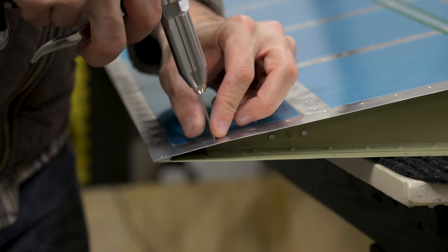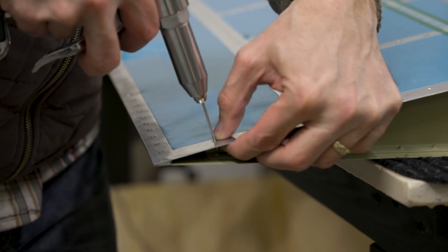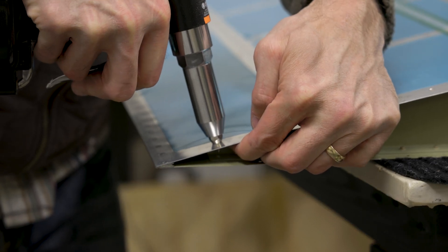Maybe other people are smarter than me, but it didn't work for me. So what I did was use NAS319BS pulled rivets - I think that's what they're called - and they can be substituted in many applications for the 3/32" rivets. You do have to drill the hole out to 7/64" rather than 3/32", and I got a reamer to do that. Reamers are nice because they don't leave much in the way of burrs. So I reamed those holes out, put the pulled rivet in there, pulled it, and got those last two rivets that were almost impossible to buck set just fine. That's how I did that.